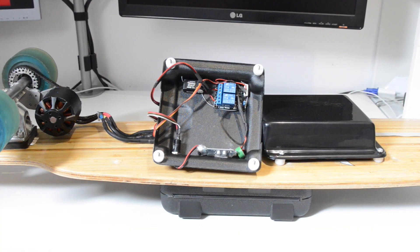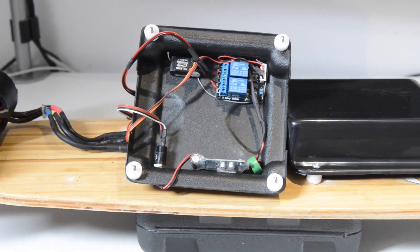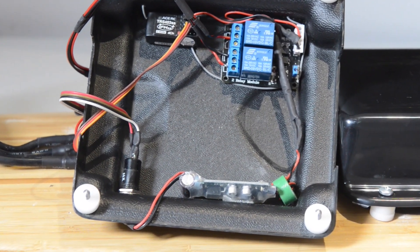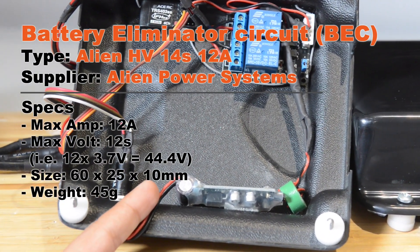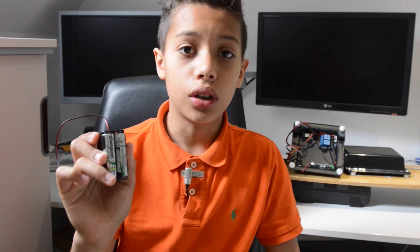ESCs have a lot of configuration options. With a number of vendors you'll be expected to configure it before you can use it for the first time, so you'll need a computer that can do that. Because the voltage from the batteries is very high — here about 37 volts — you can't directly connect the remote control receiver to it. You can either have a dedicated battery pack for the receiver, which we had before, or you can use a BEC which will reduce the voltage to around 5 volts that the receiver can use. Be warned: if you use a separate battery pack for the receiver and run out of power, you'll also lose your brakes. We're speaking from experience — it almost didn't end well.